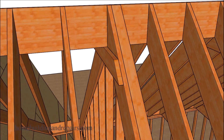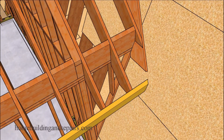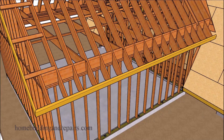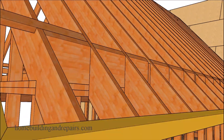I don't know if you'd really need a collar tie on this one because we do have the wall. Let's take a look at the gap between the bottom of the fascia board and the sheathing — this will allow us to install roofing materials underneath this section of the roof. This might require you to leave some sheathing off so the roofer can install roofing materials underneath. A lot of times we'll just have a piece of sheathing cut separately so the roofer can remove that section, install their roofing, reattach the sheathing, nail it off, and then install new roofing materials over that section. You could also run the block past and have the rafter tie sit behind the block if you're looking for a different assembly method.